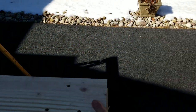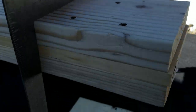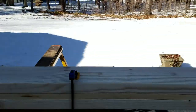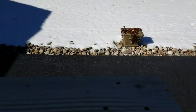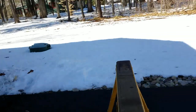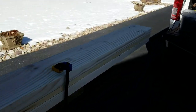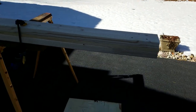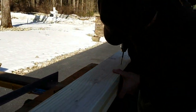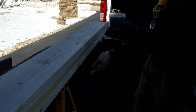The first thing I did is I clamped this side on here. You want to make sure that the top of your lumber is as square as possible. Then you take your clamps and you work the lumber down, screw from one side to the other, fasten along the way, and continually work this lumber back and forth. So if my crown is off, I'll move these pieces and clamp it to where I need to so that this top surface of my beam is flat — at least as flat as it can be using this kind of stock. I don't do any pilot holes. I am countersinking those three inch screws and I'm not worried about coming through the other side.